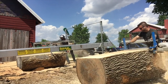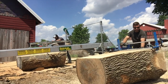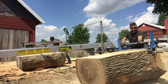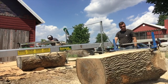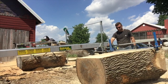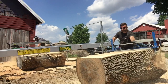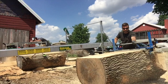Back to the chain for just a bit. We were doing some looking and talking afterward and kind of decided that a semi-skip or a full-skip chain with a milling profile might be the best. The biggest thing we're fighting — and anyone who's milling will tell you — is getting the chips and dust out of the kerf. That's the biggest problem. So I may do some experimenting with a semi-skip or full-skip chain to see what that does for my own setup.